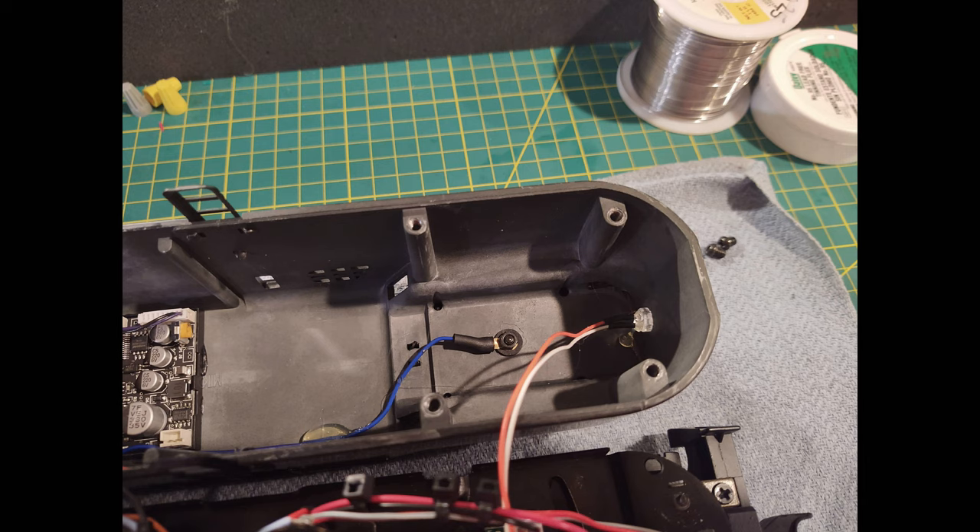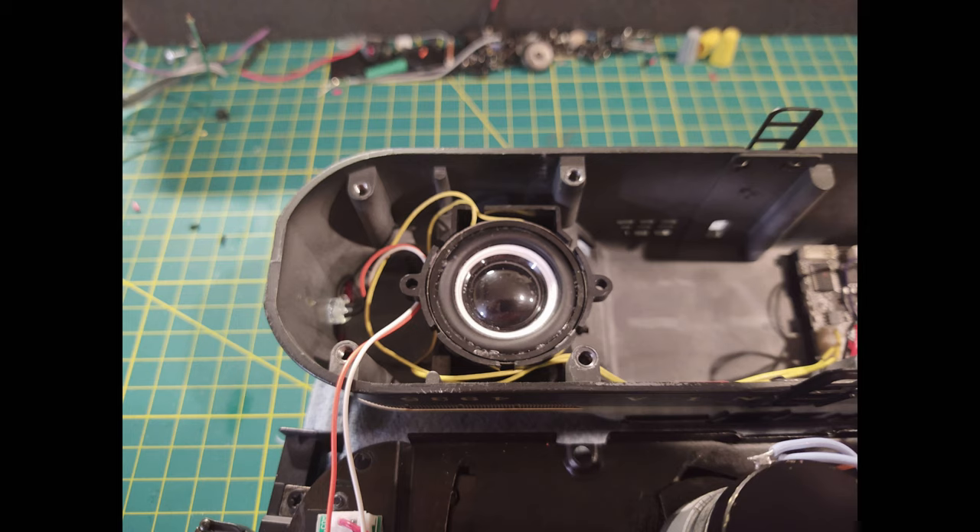Here's the other end — you can see the other LED headlight, or backup light. You can also see the speaker here. The shell had this kind of weird notch-like part on this end — the casting was just a bit different from other GG1s I've seen. I was able to slip the speaker down into that notch and attach it there, and it works really well. There are no weird vibrations, and it sounds really good when you put the shell back on and have it all sealed up.